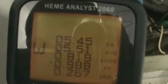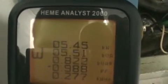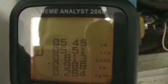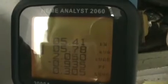Okay, I just flipped the breaker on, and I am not observing any changes in the kilowatt consumption. If anything, I'd say it went a point or so higher. Let me turn it back off. Hey, look at that, the kilowatt consumption went down. Now remember, your power meter that the power company bills you on measures your kilowatt consumption, not your kilovolt amps, which is shown right below.